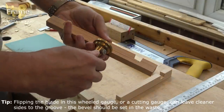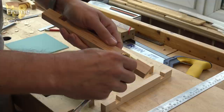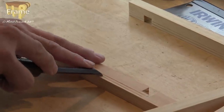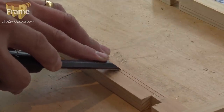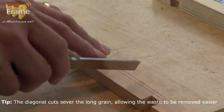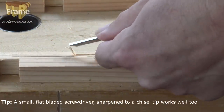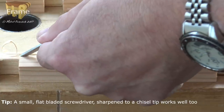Back to the original. Reset the gauge to give enough room for the mirror glass to go in. And again, gauge around all four pieces. Now if you only have one chisel it will probably take you a while, but you can just chisel towards both of those gauge lines and then do a diagonal, and you should start removing little sections from that channel. That's going to take you a long time. But if you've got a thinner chisel then it's basically like cutting a long mortise, and you see how quickly that millimetre of waste will come out.